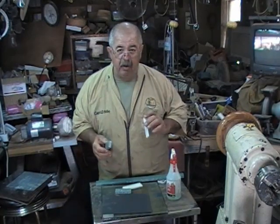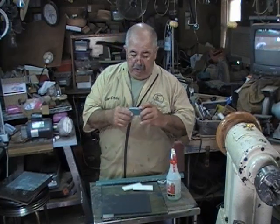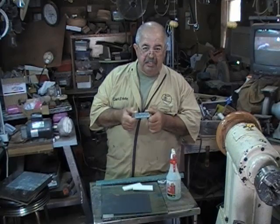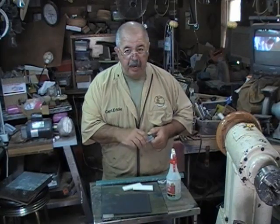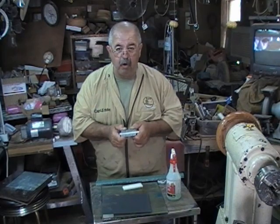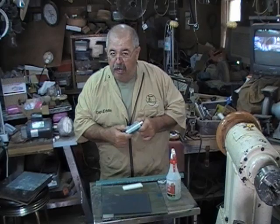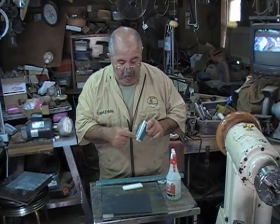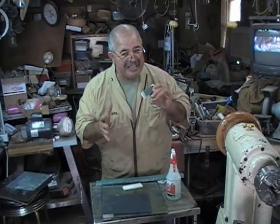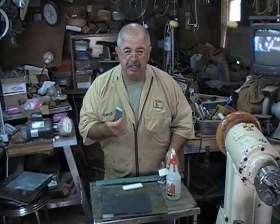Okay. Now, if you want to do a pen blank out of Corian, you need to put two of what us Americans call 1/2-inch thick pieces together. If you like to get artsy, you put what we would call a 1/4 inch in between, 12, 6, 12. When you get real artsy, you cut it on a diagonal and cut your blank out of it so the color passes through. Yeah, it depends on how artsy you want to get. This is some beautiful material to work with.